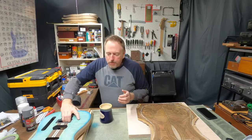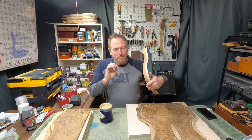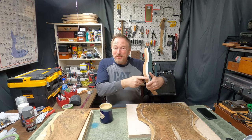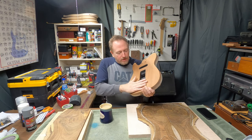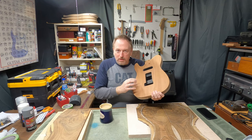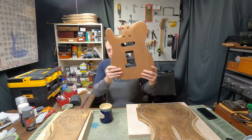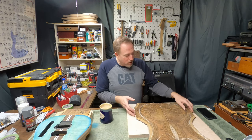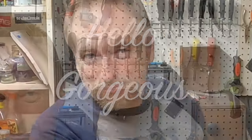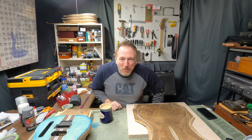So he's going to work on that, and I'm also going to work on getting this prepped. As I said last time, kind of a surprise — my wife talked me into, she didn't try very hard, she just mentioned it — doing pearl white on the back and sides. So I'm going to prep this. The back is a mahogany, so we're going to prep that because of the deep pores in there. I don't want the pores on this one to show. Sometimes I like the pores on mahogany to show — it makes for a nice effect — but I want this one to be really smooth. I'm also going to show you these pieces of wood, which are going to go on a very special X-Horizon guitar. Stick around and we'll see what all we get to today.